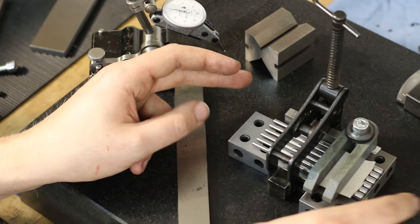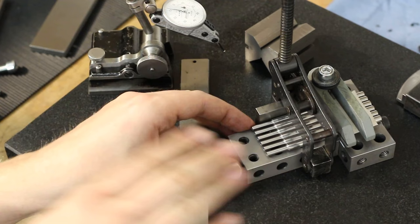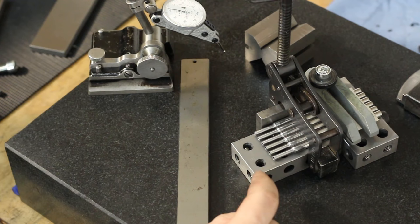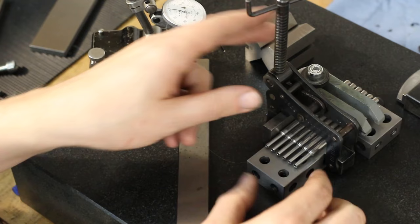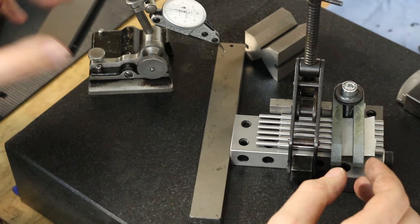And these are the exposed ends, and we will set this up on the grinder, and we will grind away all the material we don't need by plunging down. We will use some hot melt glue to fix them in place so they don't vibrate, because they are not supported underneath them. So the wax or the hot melt stuff will help to keep vibrations down.